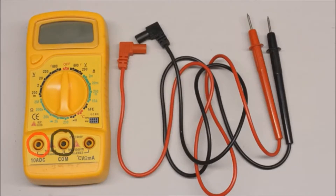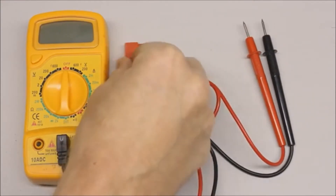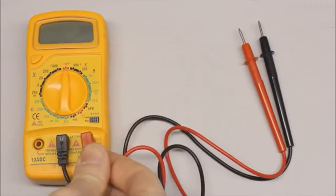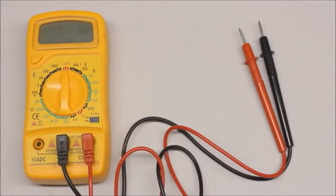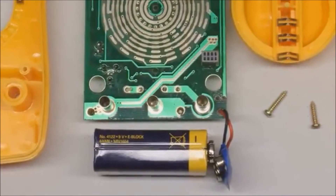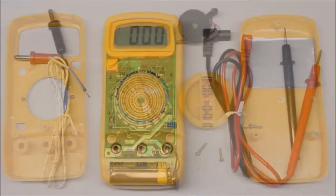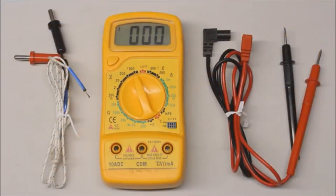There are three plug-in connectors at the front side of this multimeter. The black test lead has to be joined with the middle connector and the red test lead with the right one. The left jack is for high current measurements, which will be treated later in this video. Electric energy is needed to power the liquid crystal display and the electronics, hence a 9V battery is placed inside. Whenever the device is not in use, disconnect the multimeter from the battery by turning the rotary switch to position OFF.